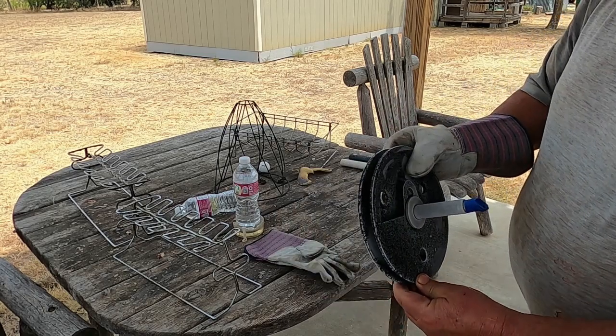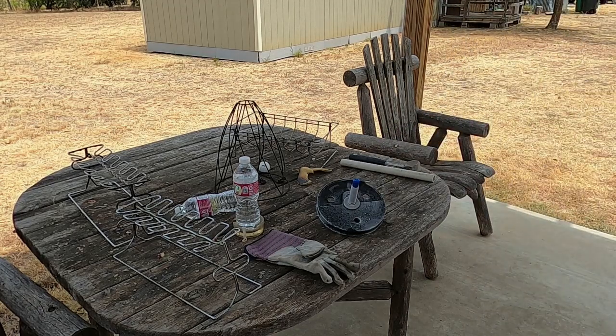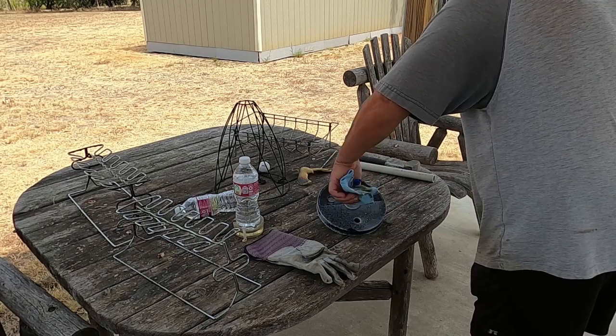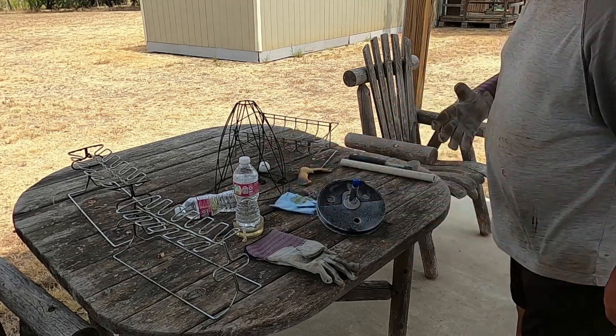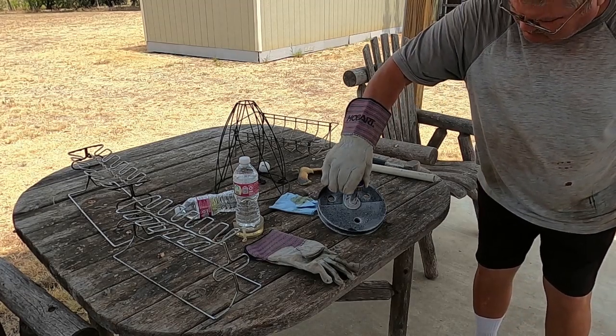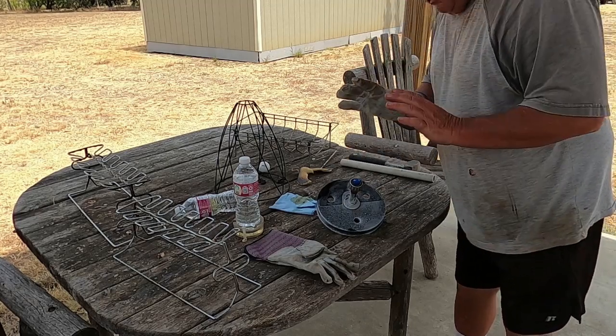This shaft has been in the freezer about three days. Let me wipe that off the shaft if it'll come off. Alright, I'm going to go grab the bearing. Yes, she is hot. As soon as it touched it, it locked up — I want to stop right there.